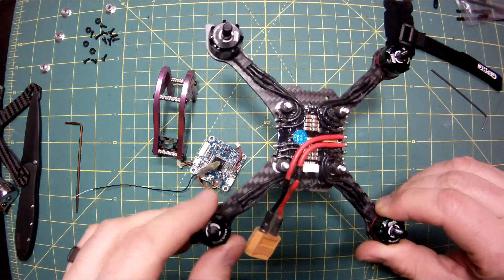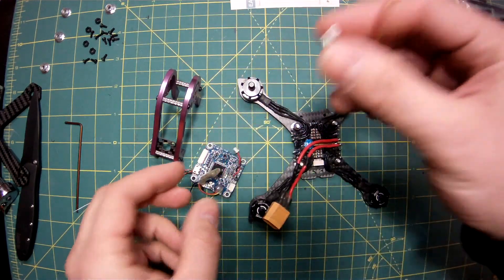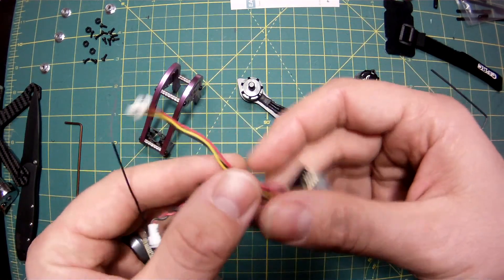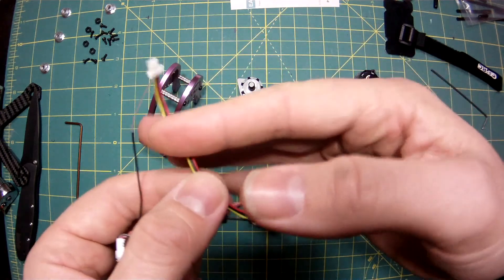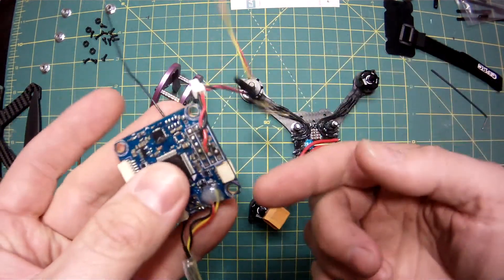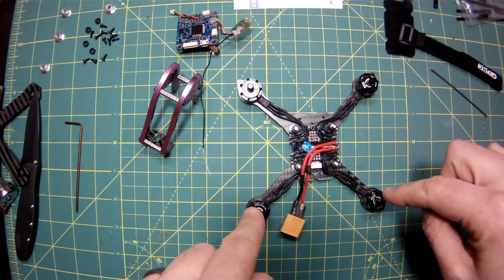Now the ESC's in place. All I have to do is get the flight controller mounted, and then the VTX-03 has an input for 1S battery voltage — it happens to be the same connector I used on the flight controller. It connects, and that'll get 5 volts through the flight controller, which is coming from the 4-in-1 ESC. The output on the VTX-03 has video and a 5-volt output with ground. So all I have to do is chop these off, splice in the other connector, and I should be able to drop that in without any more soldering to get power to the VTX and camera.